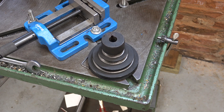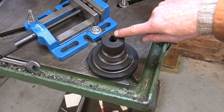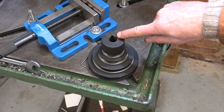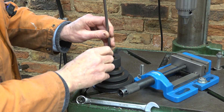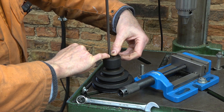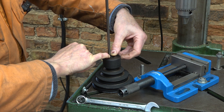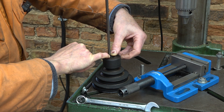It just gets better. That is a 5mm keyway, but the motor has a 3/16ths keyway, which is 4.76mm. I'll order up some 5mm keysteel and then machine it to fit the motor. The keysteel has arrived — 5mm square — but I just need to machine something off this edge here, just so that it fits the keyway on the motor shaft which is 3/16ths, about a quarter of a millimetre to come off. And I'll do that on the shaper.